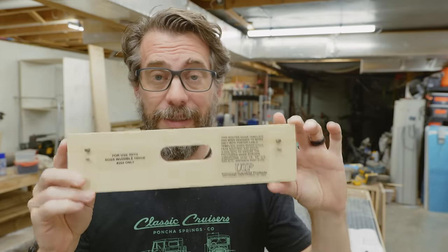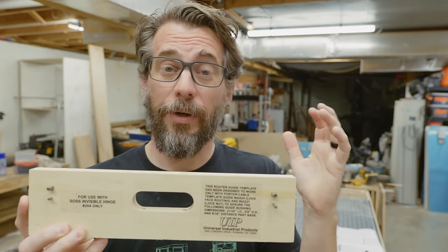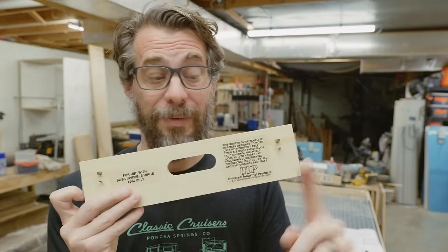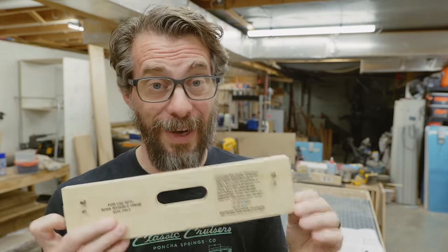The tabletops are now ready to be hinged together. To do that, I had to take out that center section and replace that thickness with a piece of walnut on each one of the tabletops — if you want to see how I put those together, check out the old video. Now, onto hinges. This time I invested about 30 bucks into a simple template made specifically for that hinge. Each one of these templates is made for a specific model number of those hinges, so you have to make sure you get the right one.